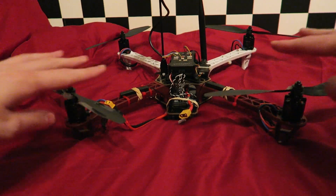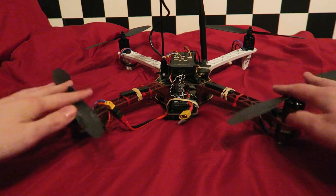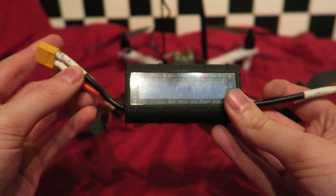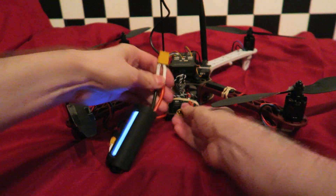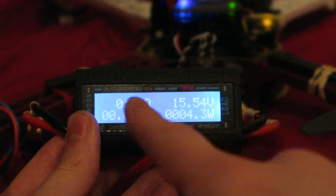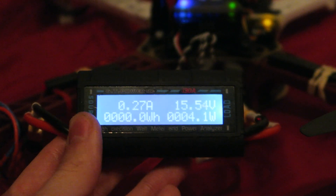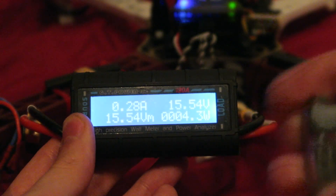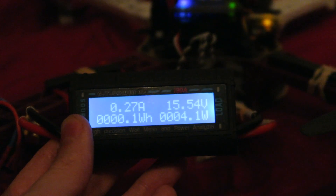You also need to balance the propellers - I'm not going to go through that here but check my channel where I show how to use the Dubro prop balancer. Now I'm going to plug a watt meter into the quadcopter. I've already soldered my XT60 connectors on from the first episode. The battery plugs in one end and the quadcopter into the other. This will show us amp draw when I lift the throttle to calibrate current in Mission Planner, and also show voltage alongside my voltage alarm for comparison.